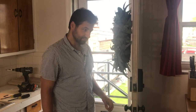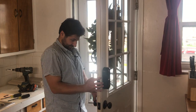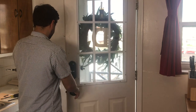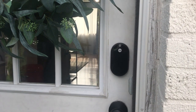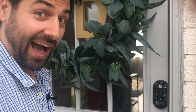Go ahead and take off the plastic protective film. Hit the Yale button to program — start by creating the master code, which should be four to eight digits long, then press the check to continue. The master code is set. Next, make sure the door is closed and press check to continue. You have to go to the outside for this step. The lock checks itself, and then: 'Installation is complete and your lock is ready to be added to your Nest account.' Woohoo!